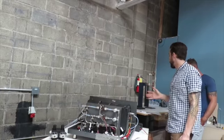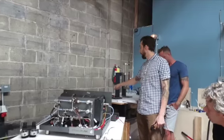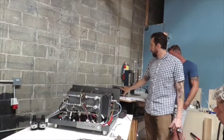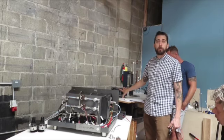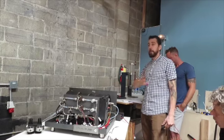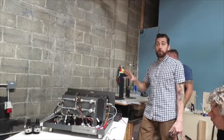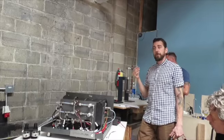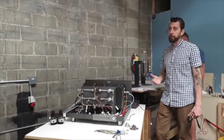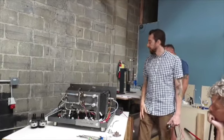And that's the other reason why anytime after any service, when you turn the machine back on, go right to switchboard and look. Like you can see right here, if I had 2 crucibles hooked up, I'd know something was definitely wrong with crucible 2 because I got a negative reading. So anytime you do any service, first thing, go right to switchboard, check to make sure all your temperatures are correct, because those are the more susceptible components, since those are using the lowest voltage on the machine. So those are always going to be your weakest components for blowing a computer.